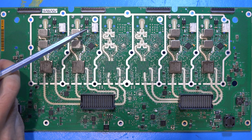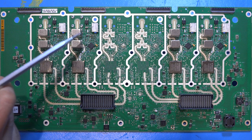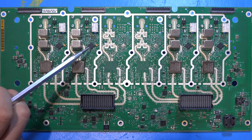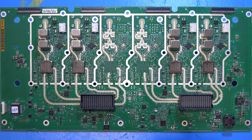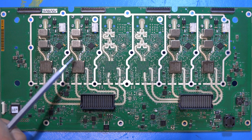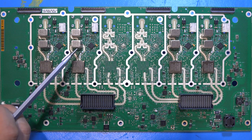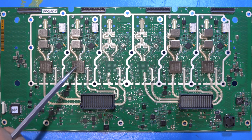The 50 ohm line turns into a very thin line for the 1 megaohm path, where it doesn't matter. There is a relay that is almost certainly switching between AC and DC-coupled inputs — you can only have AC-coupled inputs on the 1 megaohm input — plus some protection circuitry, and then another custom IC. The signal comes out differential into that chip. Even on the 1 megaohm path, they're doing some processing here — probably amplification, converting to differential — and the signal path goes through to the ADC, because this is the only IC that speaks with the ADCs directly. On the RF side, the signal splits: we have a 50 ohm path with two relay paths, one with attenuators, allowing you to reduce very high signals before they hit the IC.